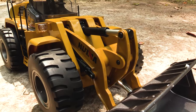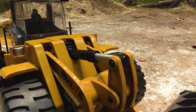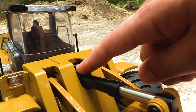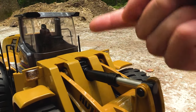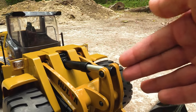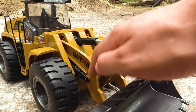Let's bring the camera in a little closer so you can see those rams. Now, how this works — it's not hydraulic, it's all electric, which means there are servos back here. You can see the head of a servo right there. It's basically like a corkscrew: as the servo spins it actually retracts or extends the front ram so the bucket can be raised or lowered. Same thing with the other two rams right here.